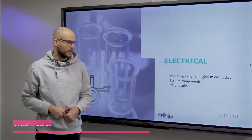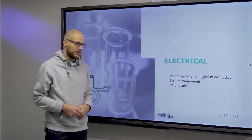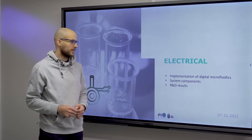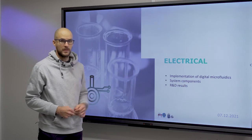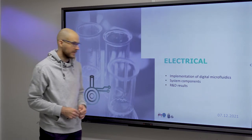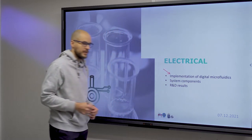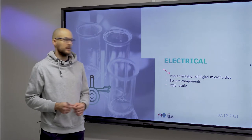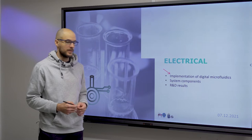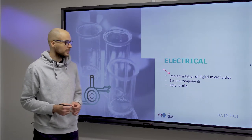In this video, I will talk about electrically controlled wetting as a tool to drive liquids in microfluidic systems. So this is an electrical approach where we use electrode arrays to drive liquid droplets. And I will first talk about the implementation of so-called digital microfluidics, which rely on the electrically controlled wetting method that I previously introduced.